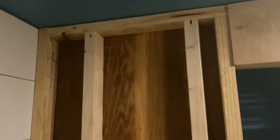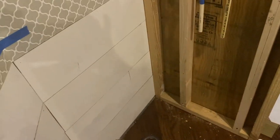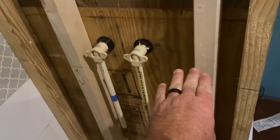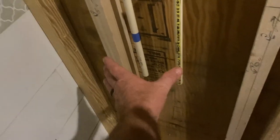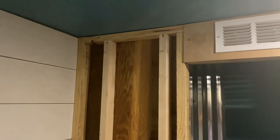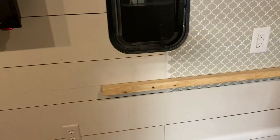She didn't like the way that wall was, so we redesigned it and put studs from top to bottom so the pipes can come straight down and over here under the sink where the water heater and water pump will be. The countertop is going to come up to here and I'm going to make a little door where we can access the plumbing inside. We'll put some sheetrock screws in to hold it so we can access that. As soon as we get the rest of the stuff in so we can get the plumbing out, we can go ahead and put that wall back and finish it completely.